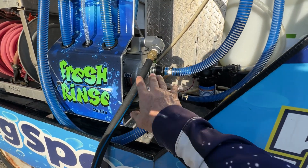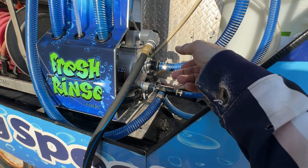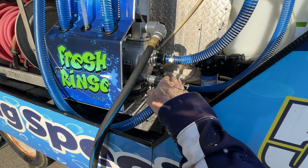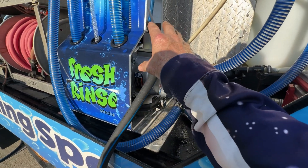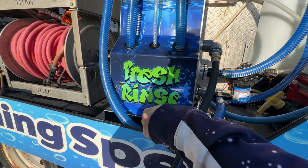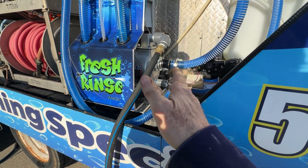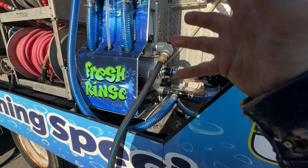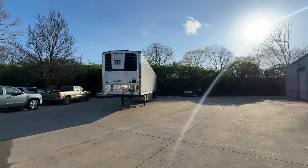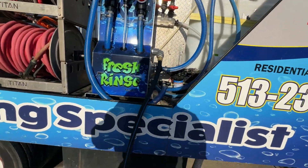The way that I set this up: while off the trigger and with no hose, I simply turned the dial here until water began to come out, then tightened it back up a quarter of a turn — just enough to stop the water. So in theory, when the pump reaches max pressure, it will disperse whatever solution is in the pump through this hose and back up into the system. It's a closed loop system — it's not bypassing, just keep that in mind. There's only one way of testing this, which is to fill it full of fluid and then go to launch and see if it explodes. I'm not risk-averse enough to do that, so let's start the machine and do a distance test with just a little bit of wind behind us.